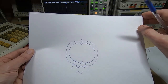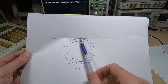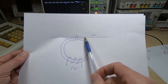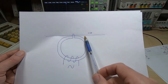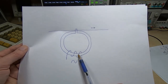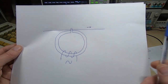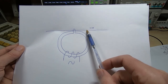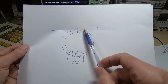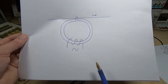Taking this a step further: we pass the tape at a constant speed past the cut in the core. The tape is coated with a magnetic media and we can modify the current state of that media by applying a signal to the coil, which makes its way through the core as flux, leaks out as a magnetic field, and that field impinges on the tape. Alternatively, we can pull the tape past the head and if the tape has information on it, it will generate a magnetic field whose resultant flux generates a signal in the coil.